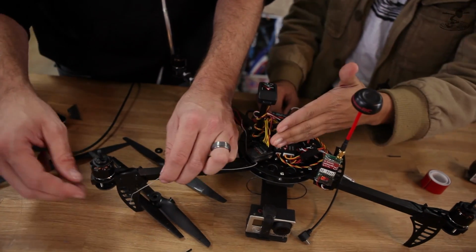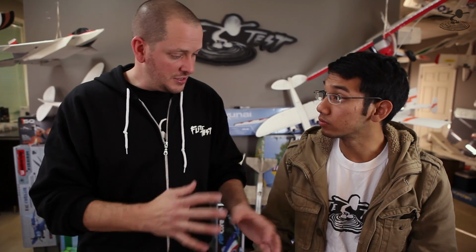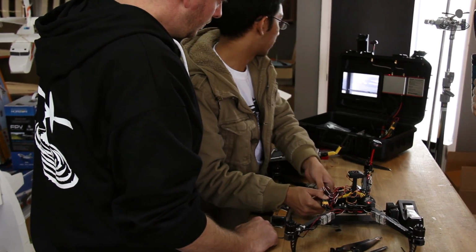Yeah, and the nice thing is the way they tell you to put these things 90 degrees out of phase from each other. Now, one reason we're putting this together here is just as we tested off the bench, it's important to go ahead and test everything before you dress it, because if you have to make changes, now would be the best time to do it. Once you know that everything's working, you can go back and dress it beautifully. They have really great things like those beautiful noodle straps. Oh yeah, like the loomed wires, kind of like the Chinese finger cuffs. Yeah, you can go ahead and dress all your wires, make it clean, but make sure everything works and is the way you want it before fastening it down, because you're going to tear that all apart if you make a mistake. So now we're going to go ahead and power it up, and we'll turn it on.